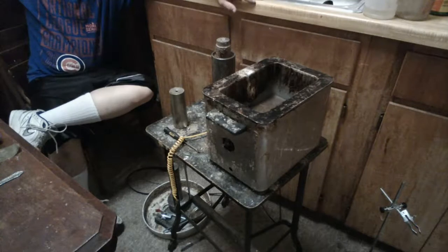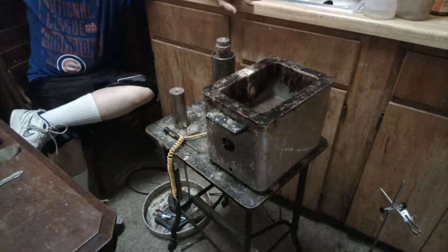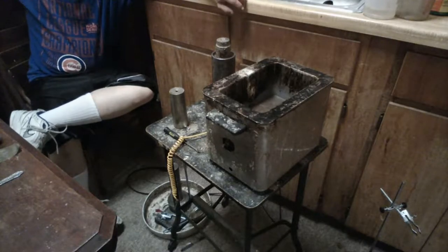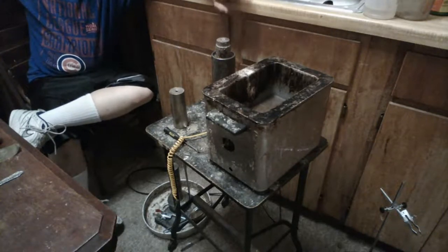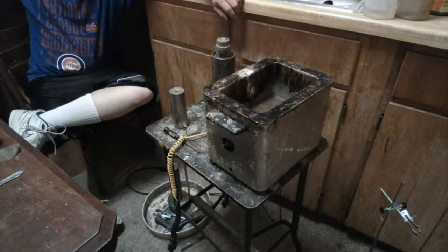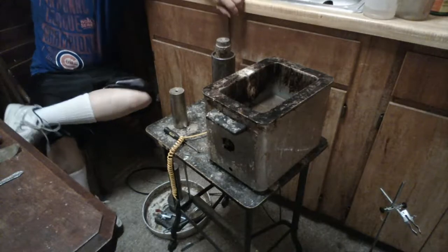So it's best to make cylinders for the average consumer no thicker than 2.175. And also make sure that you tell people to use caution and check with their reproducer and recorder that they have enough clearance so it can go up and down with any variations in the blank.